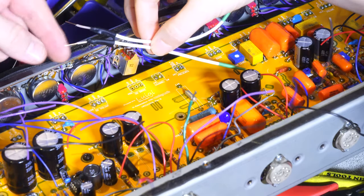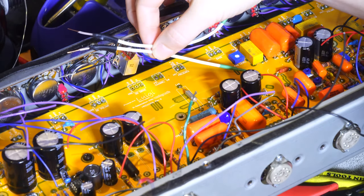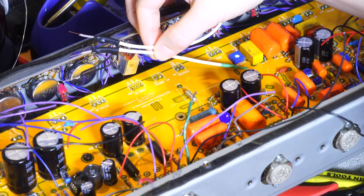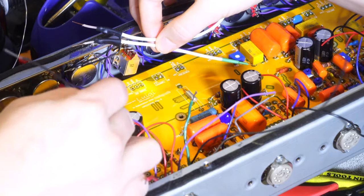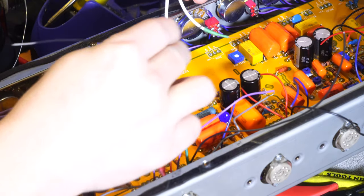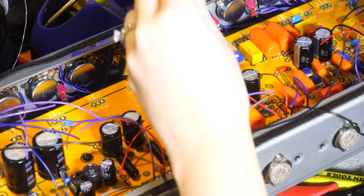All right, so now what we've got to do, I had almost forgotten this, but I've got the shielded wires, and I also have the shields connected to a ground here. That ground and these connections are going to go up to the pot, and then we'll run a third separate wire as well, connecting to the same point as those two wires, and then over. So these are our OD drive, and the other ends of these, plus this ground wire, are going to connect into here. So she's going to go ahead and wire that up now.